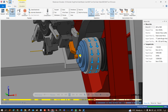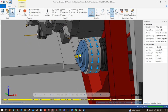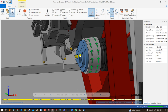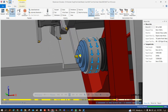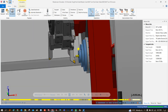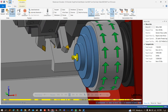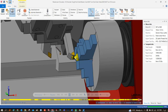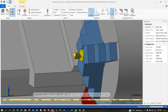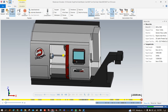In this video you will learn how to create the left-hand spindle toolpath, the right-hand spindle toolpath, the part handling toolpath, and threading toolpaths — all in a very thorough way. On the right-hand spindle the first operation is facing the extra material. You will also learn about toolpath synchronization — which toolpath to play first and which after — and when a collision is going to happen. In the previous toolpath a collision occurred because the tool was not extended far enough from the turret, so we'll learn how to make those kinds of adjustments as well.